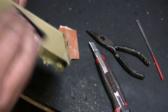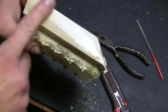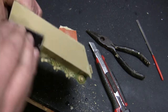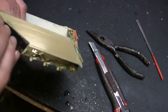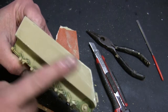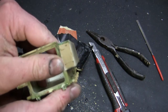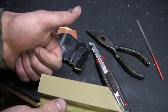And here you can see the wet sanding process in operation. The sandpaper I'm using is 220 grit. I basically just dip it in some water and I just start rubbing it up and down the surface. This does a fantastic job with blending everything in, removing the original gouge lines, as well as also polishing up the other sanding marks that I did with the coarser grain sandpaper. As you can see, if I wipe the surface clean with my finger, you're not going to see any traces whatsoever of the other procedures. When you're done, it leaves for a really good result, and it's one that really doesn't take that long. I believe this was about 5 minutes in total to accomplish.